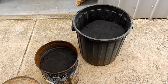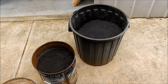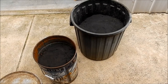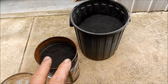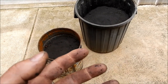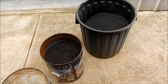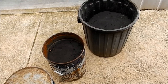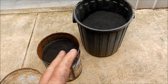Let's have a look at what we're going to use for moulding up the pattern for the jib crane. I've got two buckets of green sand left over from our foundry — this is from about a tonne of sand we used to run. One thing I don't know about this sand is whether it's got coal dust in it. We use coal dust in green sand to create a gas front — it burns when the cast iron hits it, creates a gas front, cushions that cast iron against the sand face and stops it burning into the sand. If you try to run coal dust with aluminium, it'll gas and create blow holes.